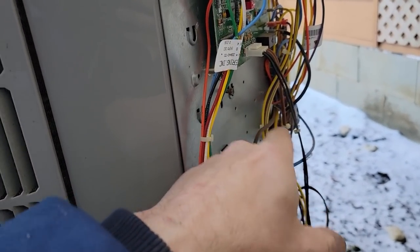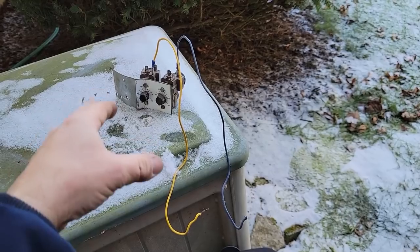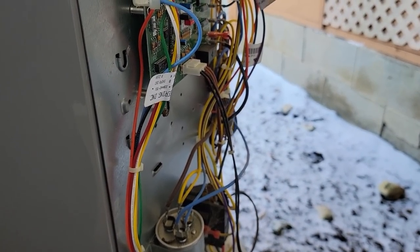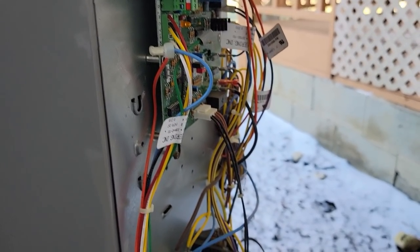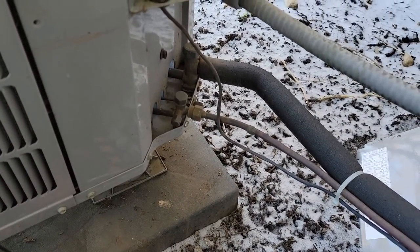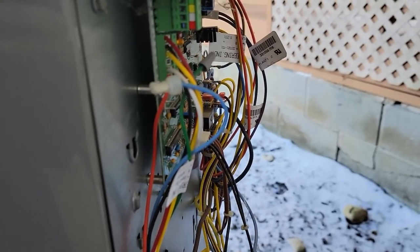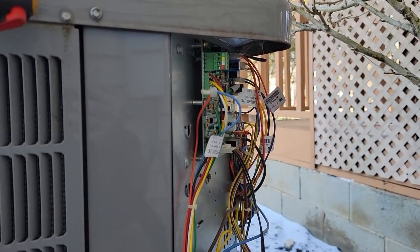What I ended up doing was taking this outdoor thermostat out - there's no reason to have it in there. How much time did we waste trying to track down why it wasn't working? If you're not going to fix the job, get rid of that garbage. Another thing I noticed - this outdoor unit is newer, it's a 2016. The air handler downstairs is a 2002, so it's been changed. Whether or not the evaporator coil was updated I'm not 100 percent certain, because it is aluminum. It's not a TXV - it's just an orifice, which is surprising. Carriers have always been using orifices on their outside units but on the inside usually use a TXV. We just need to come back and get the limit switches on the air handler - everything's been checked.